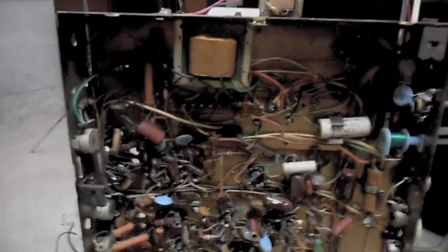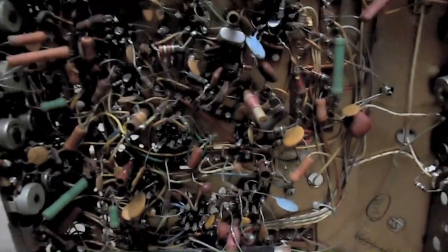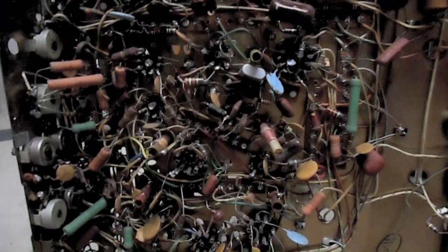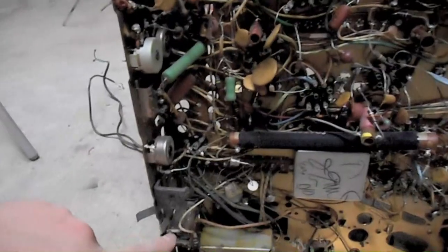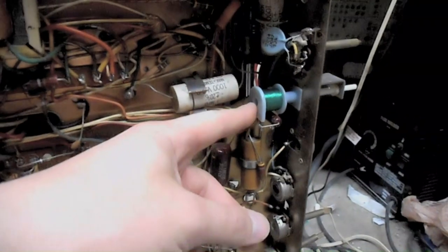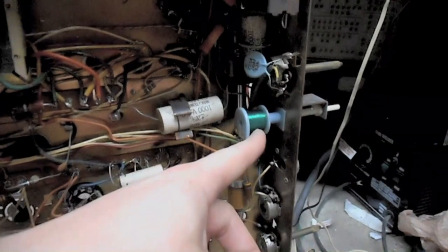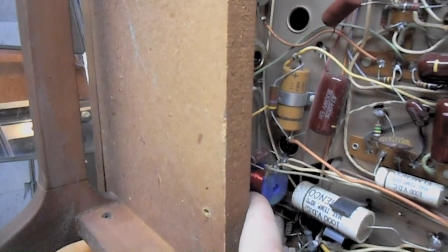And here we see the bottom of the older 24NC31 non-Z chassis, and you can see that we have a black delay line. There are probably a handful of other differences under here. The circuit breaker is obviously one that jumps out at you. The other one I'm remembering now is that the horizontal hold coil is light blue with a green winding, and on the newer revision, it's a darker blue with a red winding. So those are the production change differences.